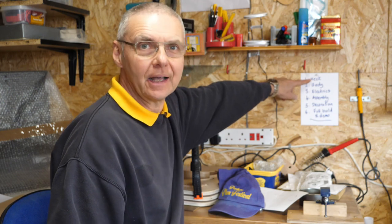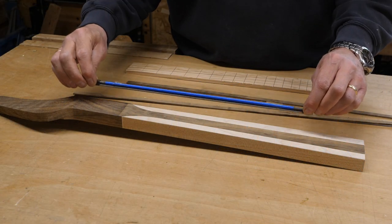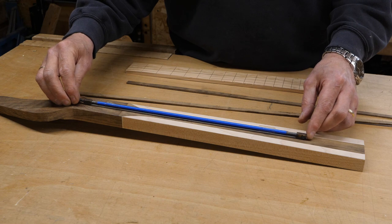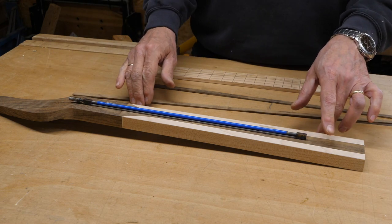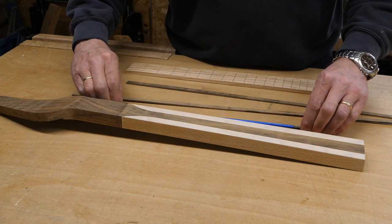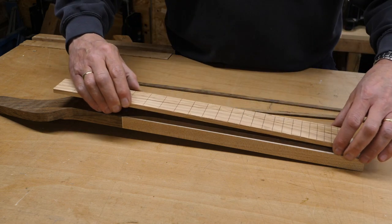I've not finished the neck. So the first thing I need to do in this episode is sort the neck out. I need to route a channel for the truss rod. I'm using a short truss rod because I'm going to use a bolt to attach the neck to the body of the guitar. I then need to plane down the fretboard